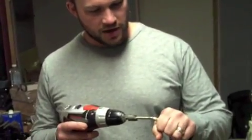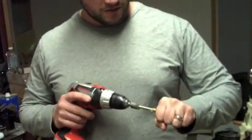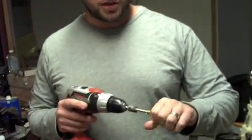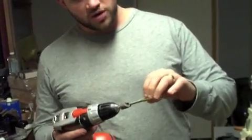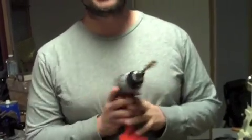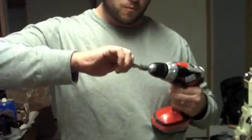We've got the brass tubes epoxied in, and now we just got to clean up that end. And the easiest way to clean up the edge there, both spots, is going to be with a pen mill that I just have chucked into a drill. So all you do is just put it right in there. Clean out the epoxy, and you can see it starting to come out. And we're going to actually shorten down a little bit of the brass at each end. So we'll give that a try.